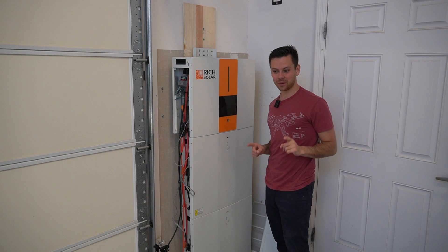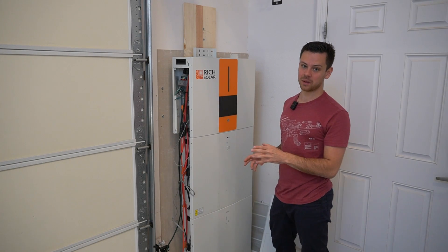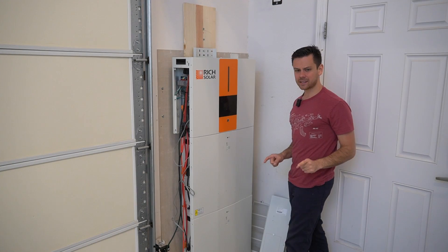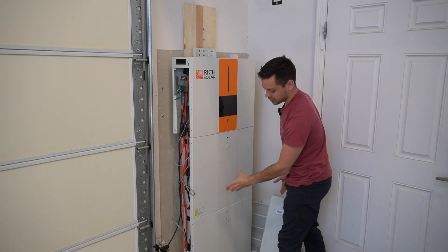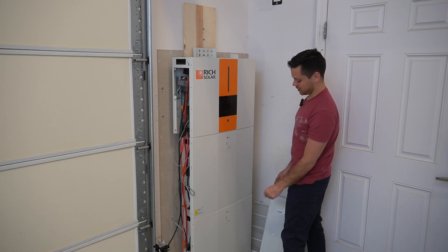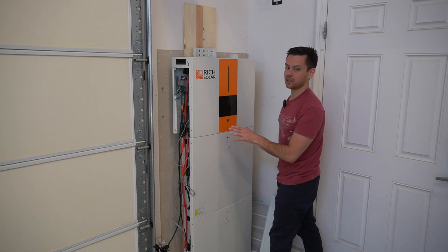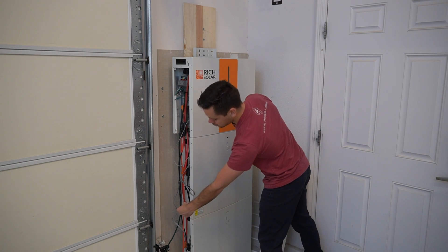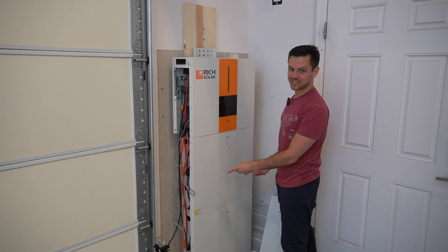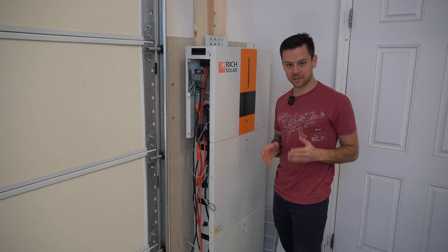You can mount this in less than an hour, but it's a little difficult. I would not recommend mounting directly to a stud with this bracket — use a piece of wood and mount that to the stud first. The manual recommends lifting the first battery off the ground with its own bracket; I didn't do that because they're ridiculously heavy. If you put it on the ground, ensure the first battery is perfectly level — once it's level you can stack everything else on top. If it's not level, the screws on the side won't line up, and moving batteries that weigh over 100 pounds multiple times is very frustrating.